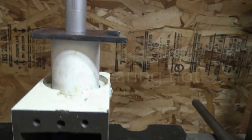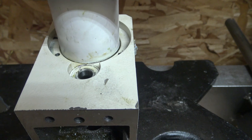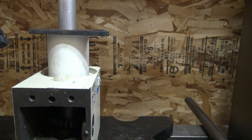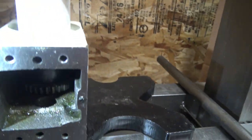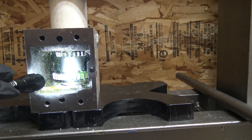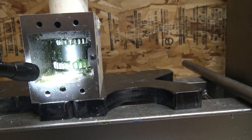Here's the setup: I used a piece of two-inch PVC that fit the bushing just fine — actually it was perfect. Watch out for the paint that's chipping away. I cut it on the lathe so it's perfectly square, then a short piece of metal. The problem was inside: once everything was set up the gear wanted to slide back down off the shaft — it wouldn't stay up — because when I honed it out I honed out enough that it wasn't forced on.